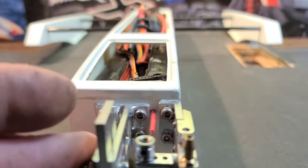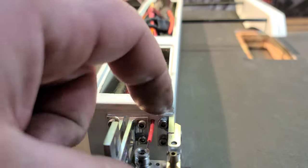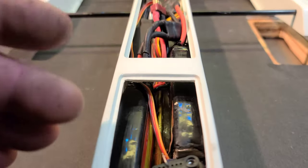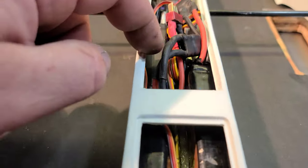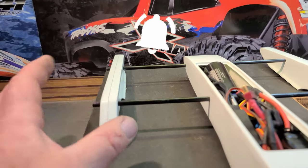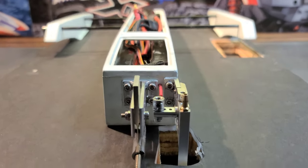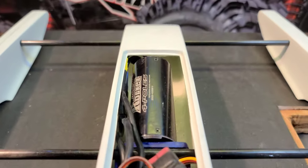We've got everything sealed up and basically installed. I used a WD-40 can straw for my rudder linkage through-hole. Got the servo in its rightful place — with the servo mounted on the same side as the rudder, I went through a lot of problems, and I hope my experience helps you guys with your build. Got the 4S battery installed, ESC, receiver box is down there, motor mounted up. Second part will be out shortly — we're gonna epoxy the boom tubes into place, finalize the setup, and do a water run on the next video.